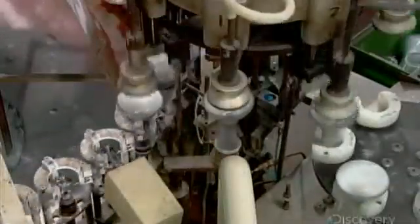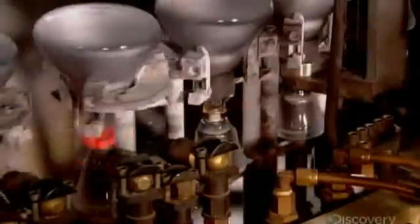Suction cups deposit the glass envelope on the assembly to encase the filament and reflective disc inside. The holder twirls the bulb as it travels past a row of torches. The flames melt the neck of the glass envelope, and it closes around the glass mount. This secures the filament, contacts, and reflective disc inside the bulb. Another set of torches, heated to a much higher temperature, trim the base of the bulb. Molding devices now move in to shape the bottom of the bulb so a metal base can be fitted to it.